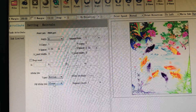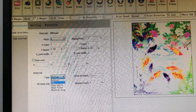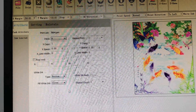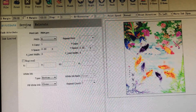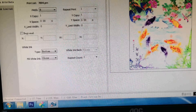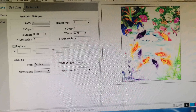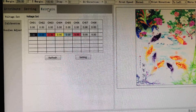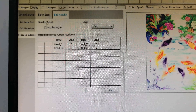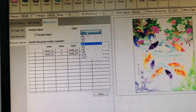Release the emergency button and move the carriage back to the home position. Then go to the software to do some settings for printing. Before printing with the rotary device, you must remove the varnish print head, because when printing on a bottle the surface is curved and can only print on the top. The varnish print head will not be working during this process, so we need to close the varnish printing ink jet.